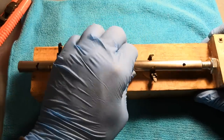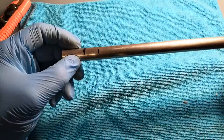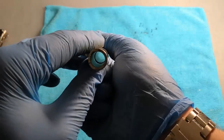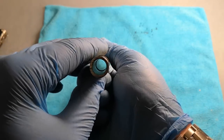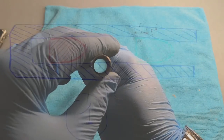And here you can see the typical effects of a bore obstruction. The barrel is damaged in the same area as the obstruction, and no other overpressure signs are present behind that point. The damage takes the shape of a bulge, which appears as a dark ring when looking through the barrel — and that is one of the first things to look for when buying a second-hand gun.